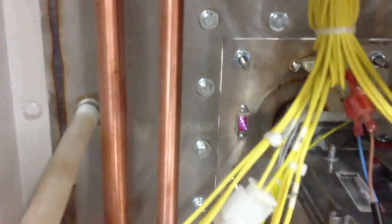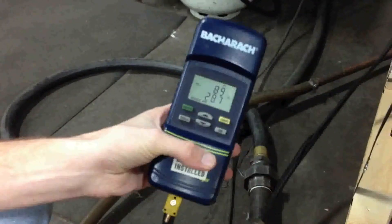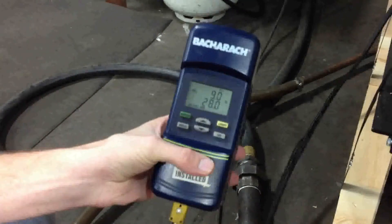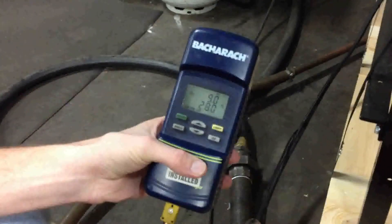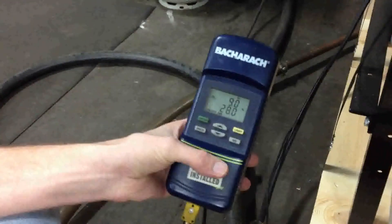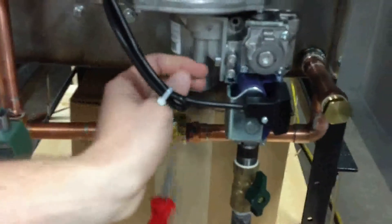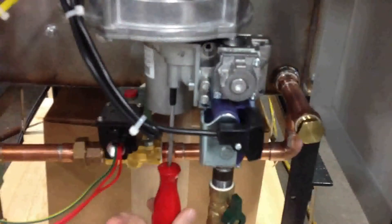Alright, now let's take a look at the actual CO2 output — that's what we're going to be looking at. In the IOM, we state anywhere from 8.5 to 9.5%. As you can see, this one's sitting at right about 8.99%. This one has been preset, as all the GFH units that leave the factory are preset to about nine. I'll show you where you can adjust this reading. On the burner package, which is actually part of the gas valve, there's a screw right up in here. You can just use a slotted screwdriver.